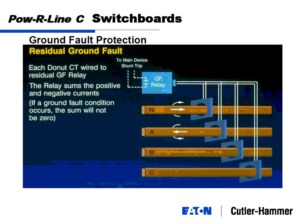When we're talking circuit breaker, we call the phase a pole. So A is a pole, B is a pole, C is a pole. So you've got A, B, and C. Where's your neutral? You don't have one in a circuit breaker. Neutral is generally landed separately from a circuit breaker, because there are certain applications where you have a four-pole device. Therefore, to do a ground fault, you have to always measure your current balance that's going to flow in the neutral. So you have to take your cable and put your neutral cable through the CT. That will give you your neutral.